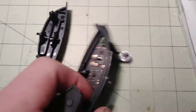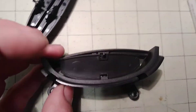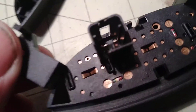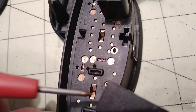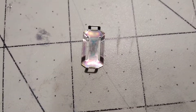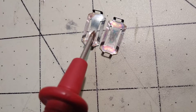Then you have this rubber mat that goes in here — the buttons need to face down. You'll see that rubber mat; it kind of keeps the contacts clean. In here you've got three resistors, and on the other side these are the switch contacts — I'm pointing to it with the multimeter probe. These are the little plates that make the contact. This one hasn't been cleaned and this one I just hit with the Dremel and the wire wheel — you can see where it contacts. I kind of just buffed it out with the Dremel and the wire wheel.